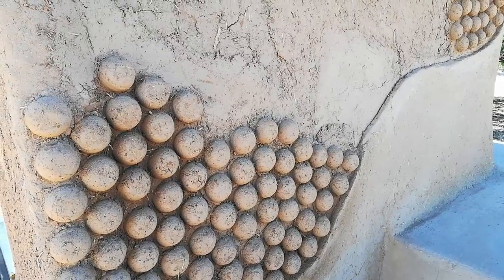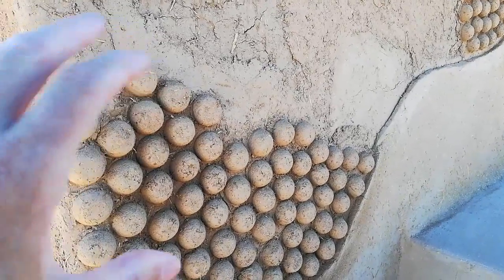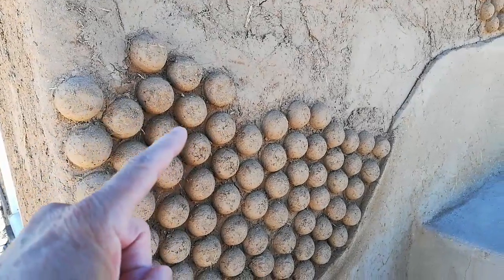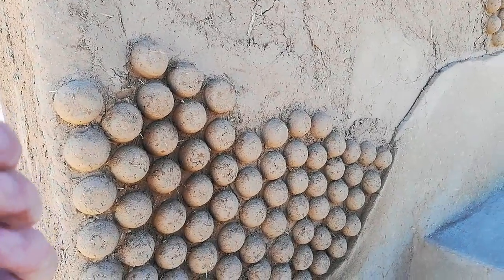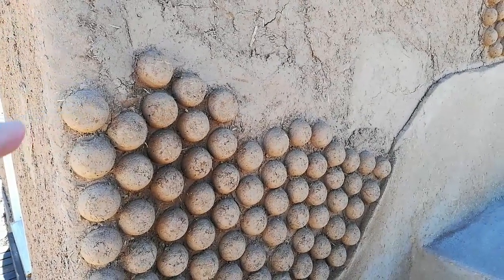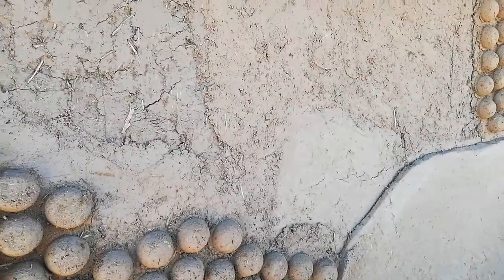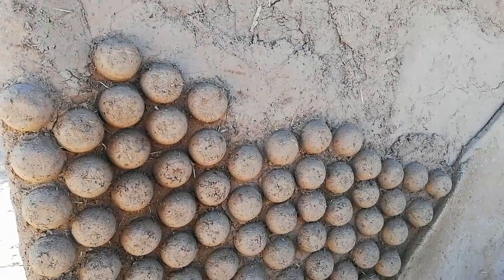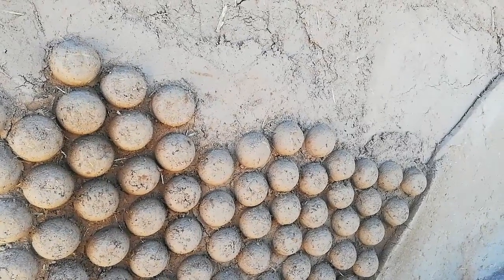The ones they make are a little more hand-formed. We figured out a technique by using a small glass bowl to create very uniform shapes, but basically the idea is each one of these spheres, when the sunlight hits it, creates what Nadir Kalali called a microclimate. There'll be a sunlit portion, a shadow side, as well as a cast shadow. So whereas on a flat surface the sunlight would hit it and it would be fully illuminated, when the sunlight hits these spheres, it creates shadows, which will also prevent massive overheating of the wall.